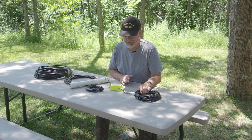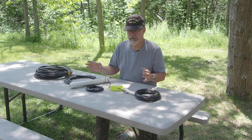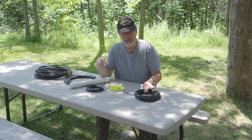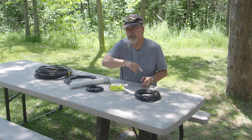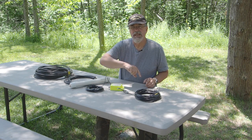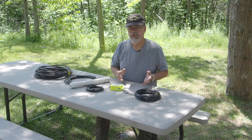Again, 124 feet 6 inches for the main wire and 30 feet for the counterpoise is what I used. If you're in a shorter or smaller lot, check out the different lengths listed below. Also, it's not really critical that the wire be in a straight line — I've mounted it as an arc, as an inverted V, as a sloper, straight across, and as an inverted L, and it works really really well.